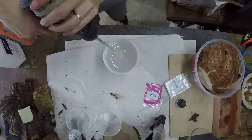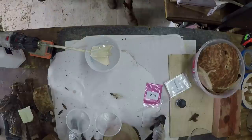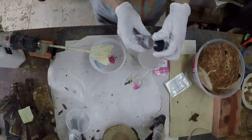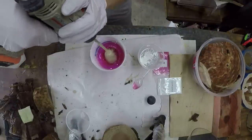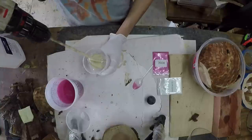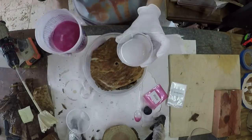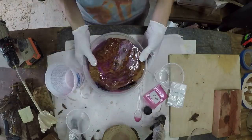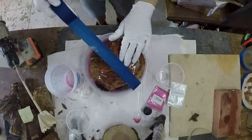I did have to do a second pour on this one, which I didn't record. About seven to eight hours later I dumped some more resin in with a lighter color and a little more swirl, and threw it back in the pressure pot. I fill my pressure pot to 50 to 60 pounds of pressure. A lot of them recommend not going over 60, so make sure your pressure pot can handle that. The reason I put 60 in is because mine has a really slow leak — by the time I come back up to the shop it's at about 30 — but it's enough pressure to get the air bubbles out. It seems to work just fine. Right now I'm looking for something to hold it down because it's floating.